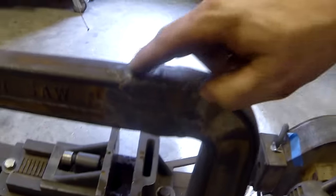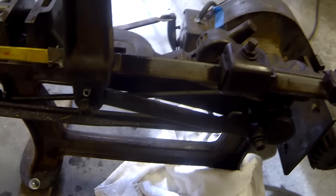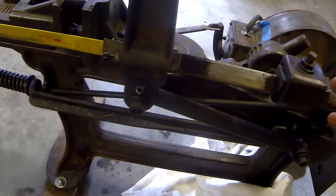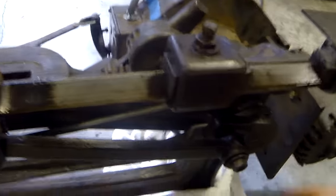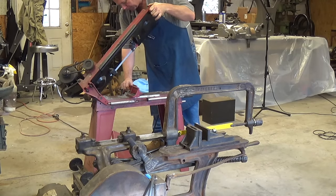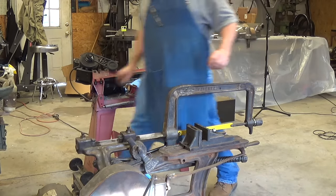The vise isn't original but it's the original type — the original would be a little longer. The saw has been brazed in a couple of places, and I've got wooden outriggers on it to keep it from tipping over since these things are real tippy. The handle is broken — I have a replacement I haven't put on yet. I replaced the pins in the motor, and everything runs really well now.